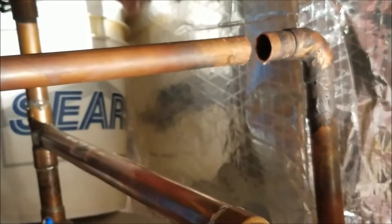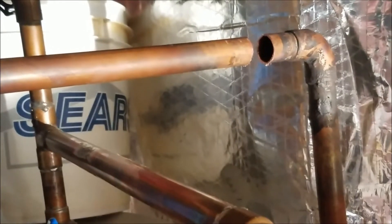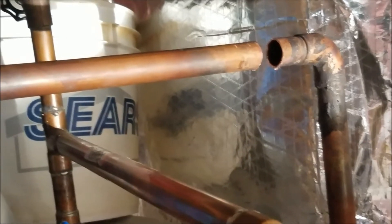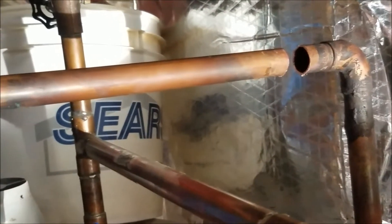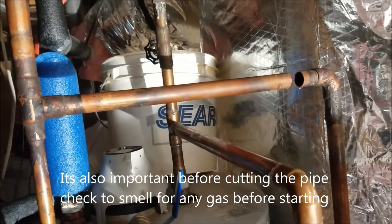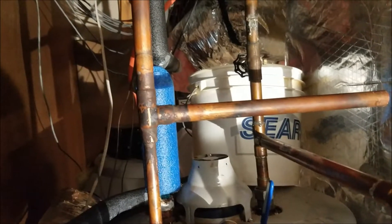The gas was one of my primary areas of concern. I had the gas company shut off the valve and then ran the furnace to try to take out all the residual gas in the line. Once that was done, I let it sit for about two weeks, and then I was able to cut the pipe. Everything will work fine.